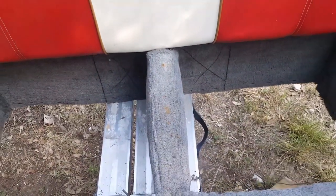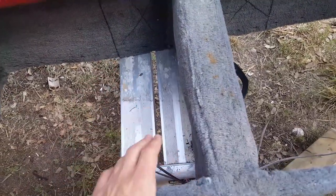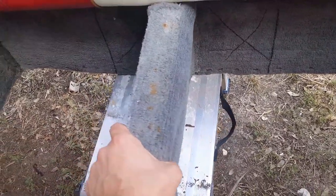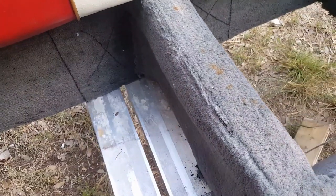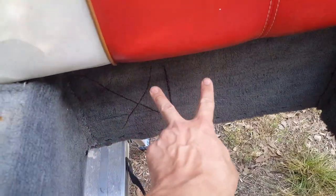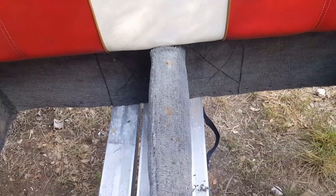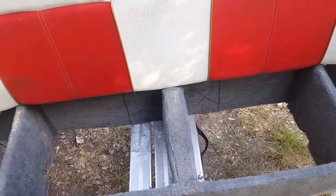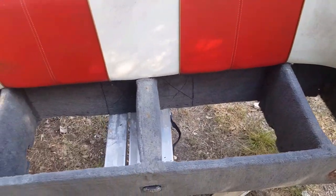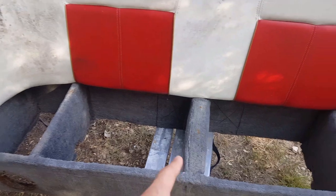You can also see here — if you remember when we were installing the fuel tank, there was an access port towards the bottom. The people who designed the boat originally essentially made it where you couldn't access underneath the floor to look at the fuel tank if you needed to, because they put this centerpiece. So what I did was I notched out where a new center needs to be on this side and one on this side, and the X indicates don't put anything there. It's a better design — if you ever need to look under there to see if a fuel hose fell off and may be leaking, you'll be able to see that. That's gonna be one of the improvements we're gonna make.